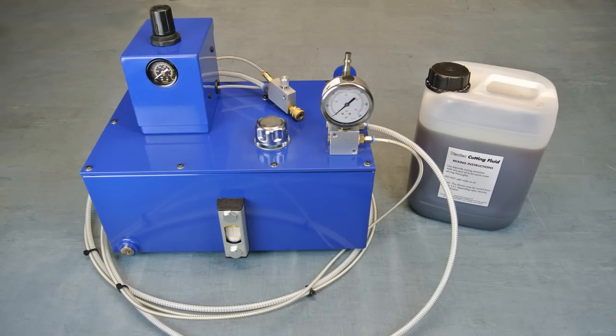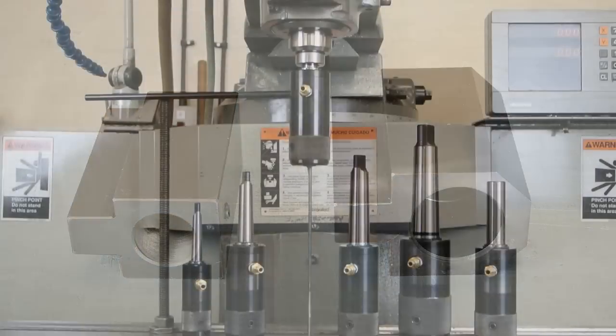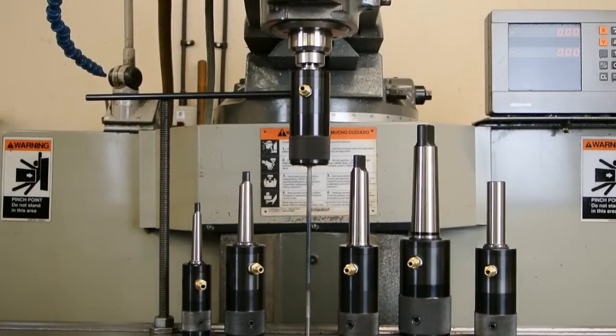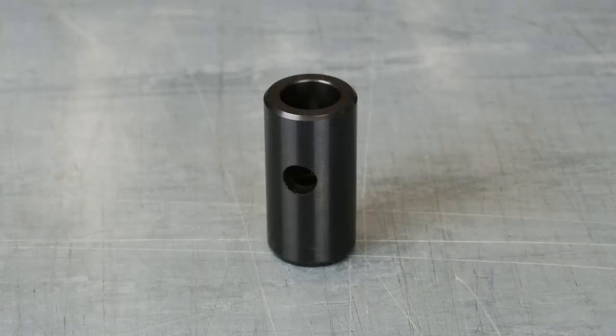A Spraymist tank and cutting fluid. A Ventec drill tool holder that is suitable for your machine. This will be either a stationary centre lathe holder or a rotating holder for use on a milling machine or horizontal borer. Rotating holders are available with straight shanks and Morse tapers. Reduction sleeves may be purchased to make it possible to hold a range of drivers.